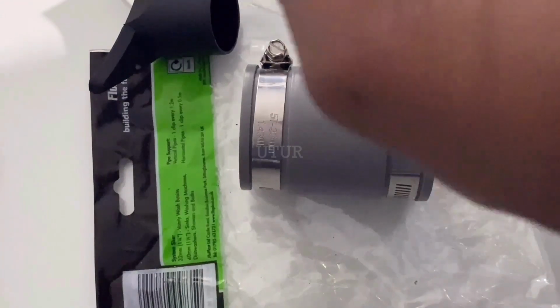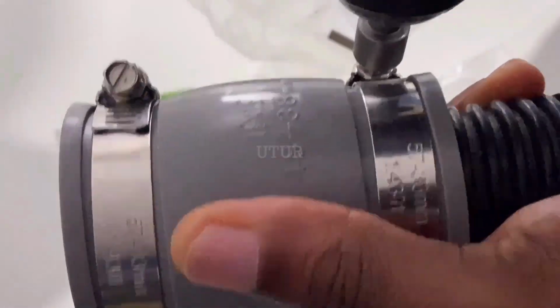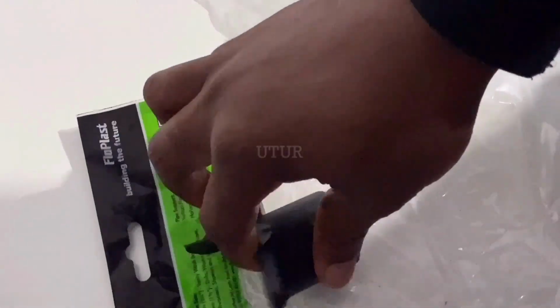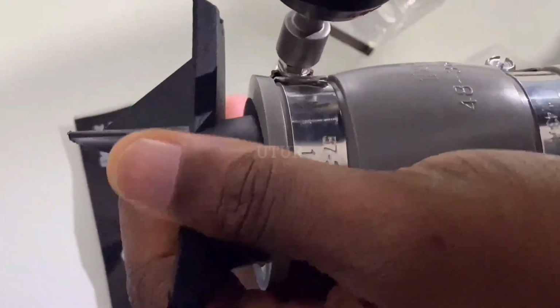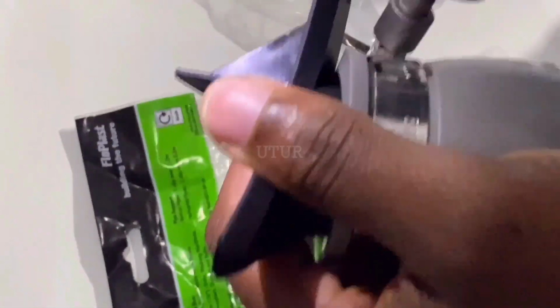Don't try to push it in. Set it up into position, then tuck tighten gradually, okay? And your clip teeth should come back to full functionality. So here we're replicating the process for the 40mm coupling, and you can see the force of the drill yanking the coupling and the flexible hose away, and that's what we're trying to prevent.